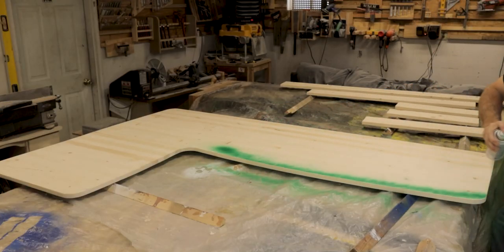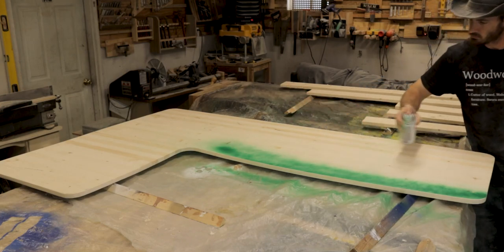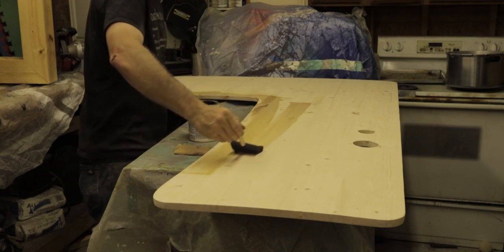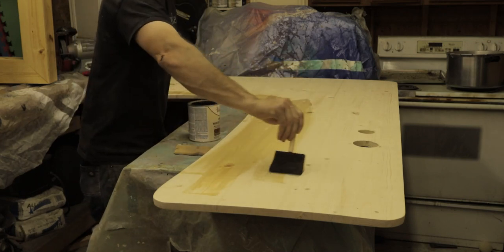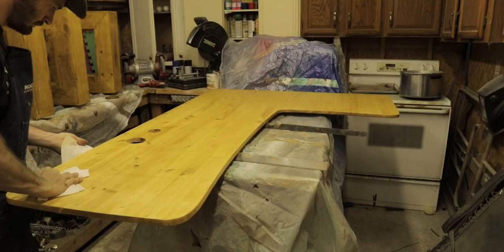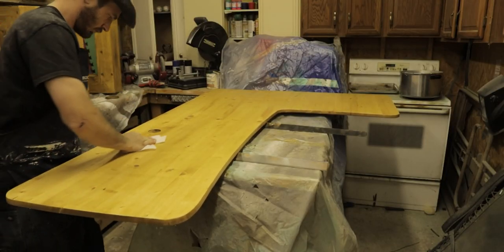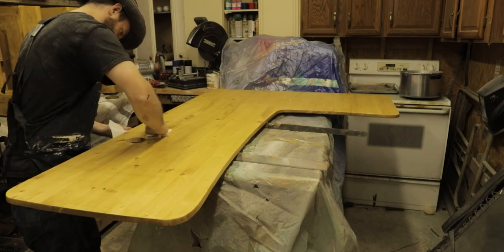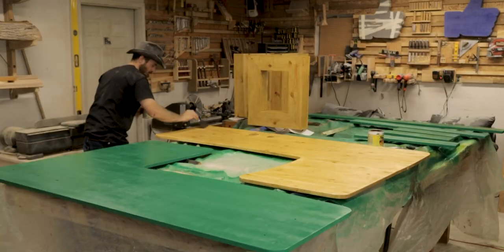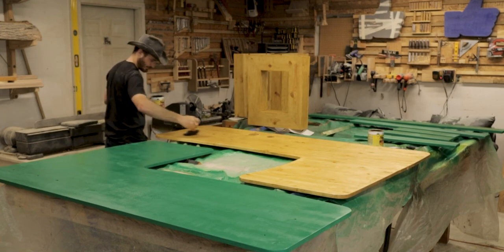The runners on the bottom panel got two coats of forest green paint because it's one of her favorite colors. Then the top panel and the legs got a pre-stain and then a golden oak stain. I always love how well these gel stains work but it does take a while to buff off all the stain before the top coat goes on. All of the pieces of the desk are going to get two coats of shellac, and the top gets three, sanding between each of the layers since this is the most visible surface.